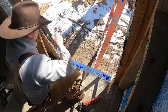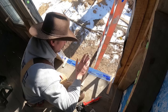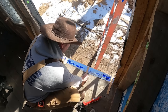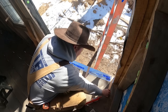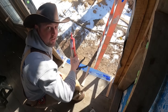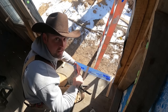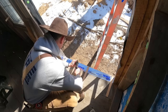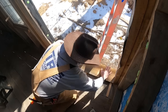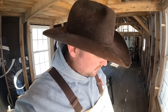That is what you call good enough for who it's for. Before I permanently set that threshold down, I'm going to get my shims right exactly where I need them, then run three continuous beads of sealant underneath it. Water likes to find a way, so if it does get under there, it's not going to keep going into the house. We might have managed to split the end of it — we might fill it with Lexel and keep going.